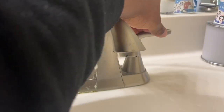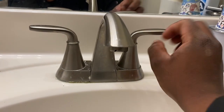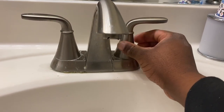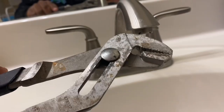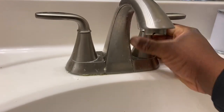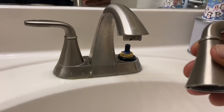We're going to start with the right one. To remove the handle on this faucet, you want to turn this collar — not the handle itself, but the collar — turn it to the left. This may be kind of hard to do by hand, so you may want to get a towel, wrap it around, and use channel locks. Put them around it and twist the whole thing. I already got it kind of loose — keep turning it until you can pull it straight up, just like this.